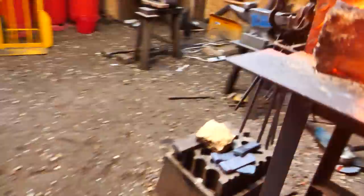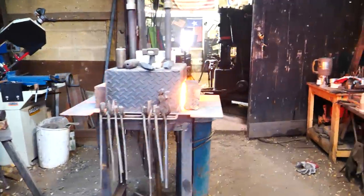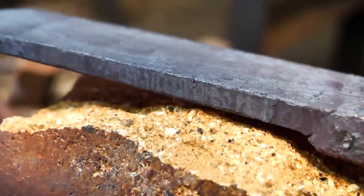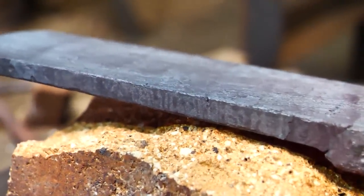We did it! Woohoo! All four are down there cooling. I'm going to turn off the forge. It is hot in here today. There is one that has a delamination on the backside — this is the only one with an issue, and it has a slight little bit of delamination. Now this is going to be on the rear of the hinge. Hopefully it's not a structural issue and since it's on the rear you won't see it afterwards. I'm going to see how that goes. Hopefully this isn't a massive problem — I don't think it is. I'm still feeling pretty damn positive.